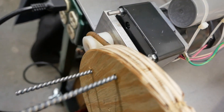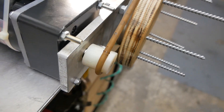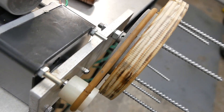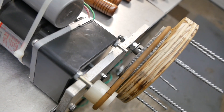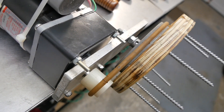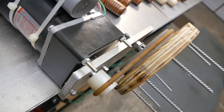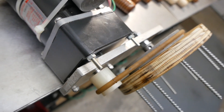I had this little hand wheel and I turned a groove in it on the metal lathe. And I made a Delrin pulley for the motor itself. I needed a drive belt, so I took a piece of surgical tubing and joined it with super glue. We used to make belts for turntables back in the audio days — for record players with belt drive. We would make belts the same way when we couldn't get replacements.